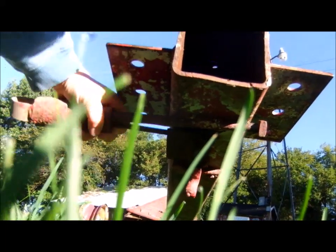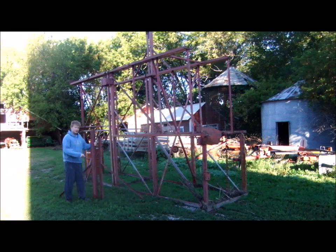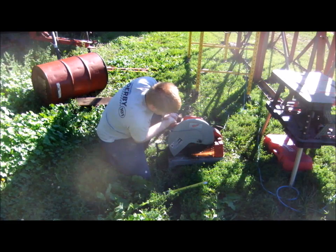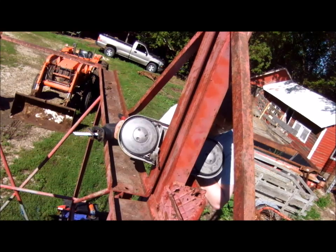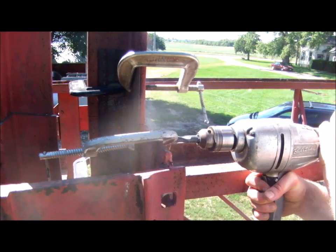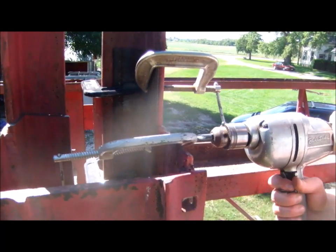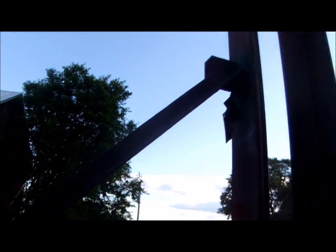Very simple mechanism, it works super well. Getting this trebuchet ready for pumpkin chucking takes more than just fixing that wooden arm. Here are the uprights — I'm showing how these uprights have to come off in order for the whole frame to fit under power lines to go down the road and make it to the fairgrounds. So here I am cutting some pieces of angle that I'm going to use to bolt on those uprights instead — apparently they were welded on — and here I am cutting them off. I didn't have a torch so getting these uprights to bolt back on again became a drilling operation which turned out to be a ton of work. I clamped my piece in place, drilled holes bolting them together, and after I got the bolts secured I would come back and weld it to the upright.